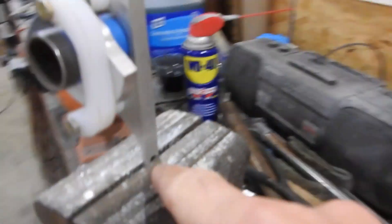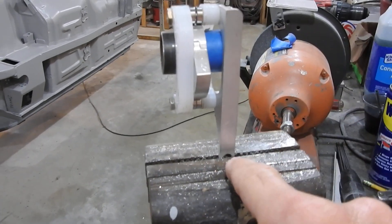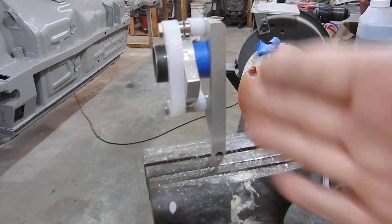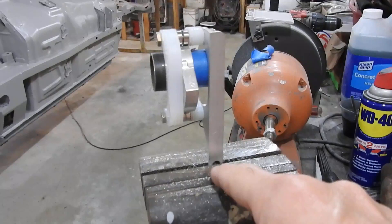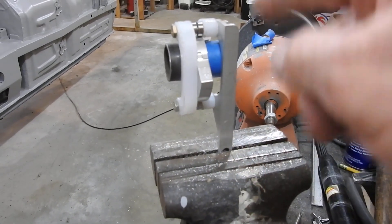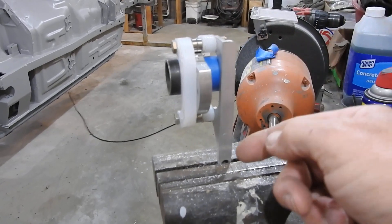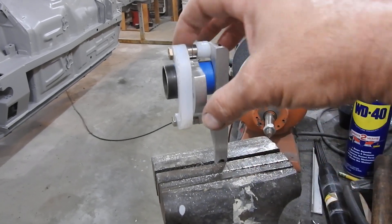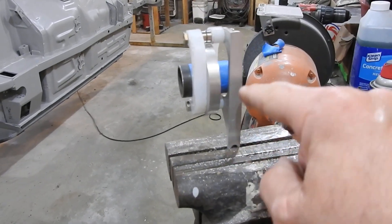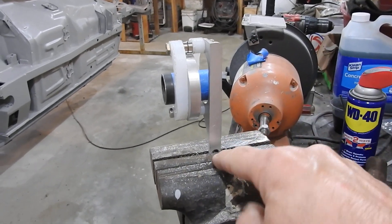Then I made this piece — there's a small hole drilled in there that hooks onto the actual linkage that pulls the gear up and down. The problem I see is I made this one while the gear doors were hung wide open and I mounted and located the hole for that. Then when I tried to bring it up — I was just manually turning this, it wasn't tightened onto the tube yet — to get the gear doors to operate, I found out that when it was all the way up on the high side of the cam, it wasn't enough. The doors were still open a good inch and a half, so that hole needs to be farther down.